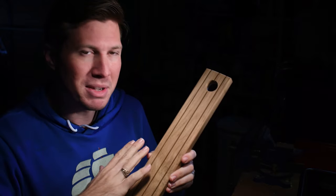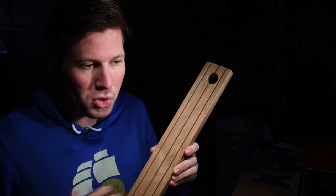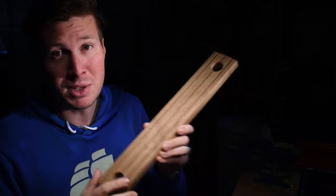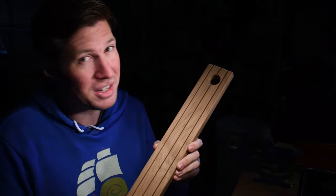Being dry simply means that all the moisture has been drawn out of the wood, but the structure that was there to pull the fluids through the wood is still present. And believe me, when you put a piece of wood in moisture, it'll just soak it right in, and those little tubes, they get working again.